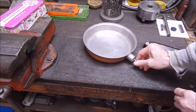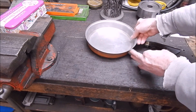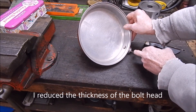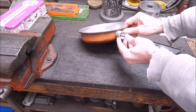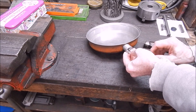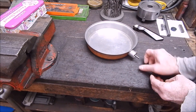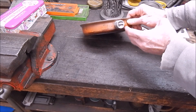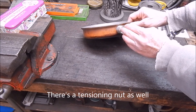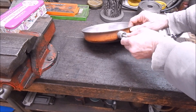So I got the old Chinese lathe going and the home-cast aluminium. I've machined up an adapter to fit on here — there's a stainless steel bolt in there. It just needs something for it to pull up against to give it some strength. So I made this up out of some home-cast. The wooden handle will go on here and screw on using the thread on the bolt, screwing up inside, coming out over the edge of the aluminium to give it support around the edge. The thread in the middle holds the whole thing together — it just screws on.